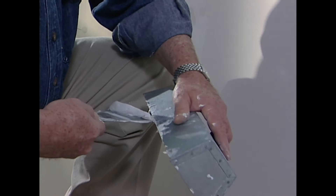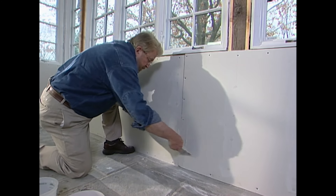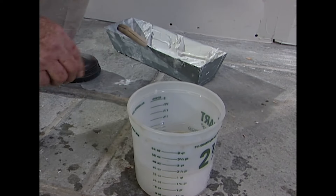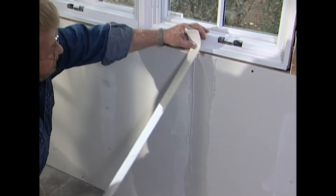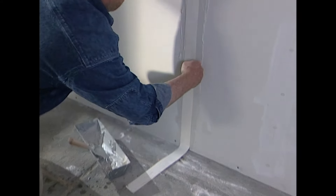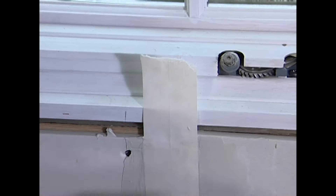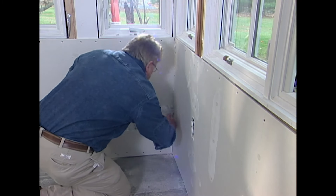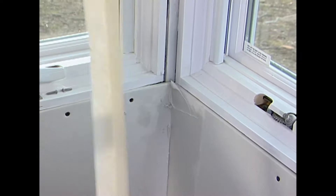To finish the wallboard, I first cover the recessed screw heads with joint compound, then apply a coat of compound to the joints themselves. I like to wet my paper tape before applying it — for me it sticks better and I seem to be able to avoid air bubbles. I lay the tape along the joint, then press it into the compound, keeping the knife at a shallow angle. Taping usually requires two or three coats of compound, each one applied with a wider knife. I tape the corners the same way, first applying a bedding coat of compound, then fold the tape and lay the crease into the corner of the wall, pressing each flap into the compound with the putty knife.